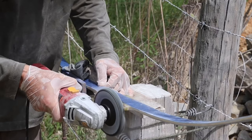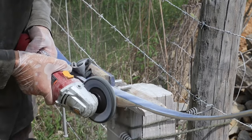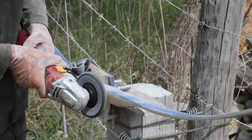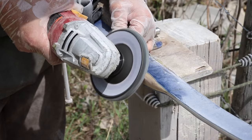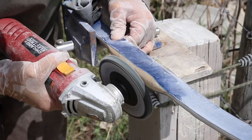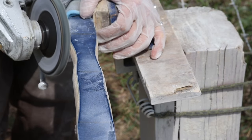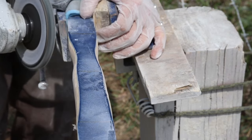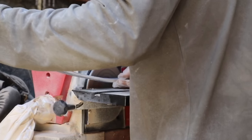When you start shaping the handle it really gets exciting — you start to get those butterflies, like 'this is looking like a bow, I'm going to be shooting this thing soon.' If you did your lines right and shape it to those lines, you're going to have a bow. You can see how fast the material comes off — here I'm applying more pressure than on the limbs and starting to shape the preliminary handle. You can shape the entire handle with this tool once you become confident. On the disc sander, I'm cleaning up the tips with more finesse and control, getting them streamlined and skinny, taking out the line at the tip.